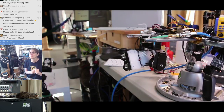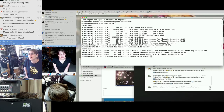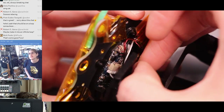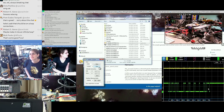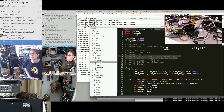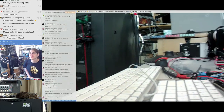And then some of this stuff might be more familiar from the recent streams. It was going into the reverse engineering behind the gimbal and making that actually work well for our particular project. This is getting a little meta. So, talking about the debug port and how we eventually used that to get the firmware off, sort of, by using that to get the encryption key. But first we were spending a lot more time just focusing on the serial protocol and trying to understand it that way, and then accidentally breaking it, getting some good graphs out of it. I had to show the video from the gimbal, even though it was a little bit shaky at this point.